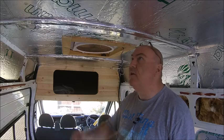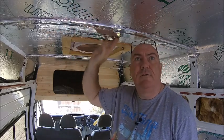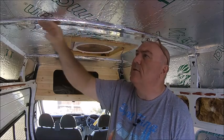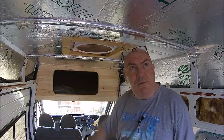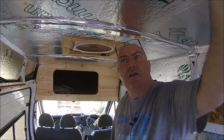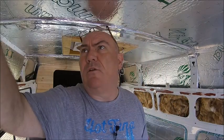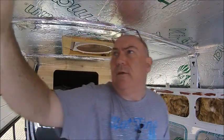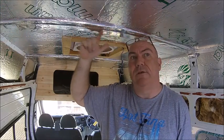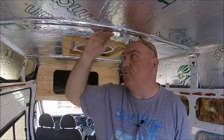So I've been sealing up these beams where the ceiling insulation meets the beams and the battens. And just been sealing them up with the foil tape. Yeah. And it was a bit tricky because when I came out here this morning early, it was cold. It's a cold October morning, so there was moisture on the beams. So I had to wait until it warmed up a little bit, wiped them all down, then I sealed it up.